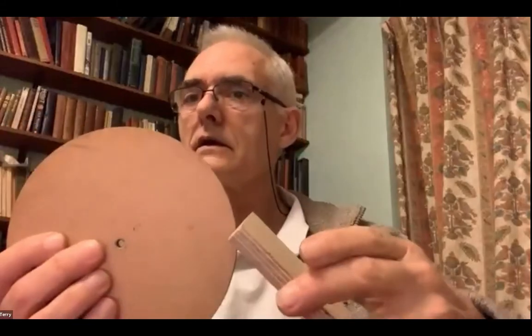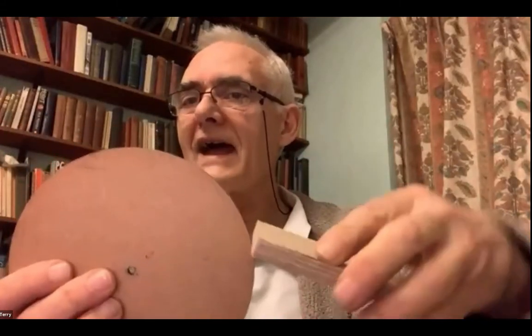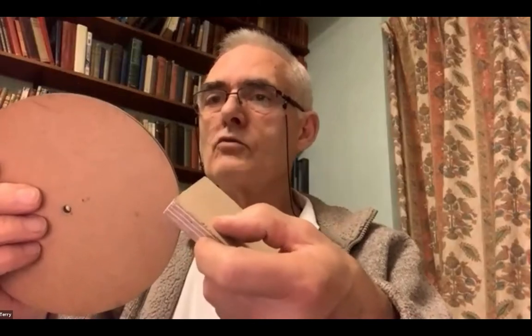You can make systems like this. If you do, it's best to have the pivot point at the front. So pivots like that, not like that. That works, but that's better, because doing it this way, you stay close to the wheel. For safety, the gap between the tool rest or platform and the wheel should be absolute minimum, almost touching, so your fingers don't get in there. When you're grinding, you're working with the fingers very close to the wheel, so you have to watch out for that. So platform grinding for the flat tools is very easy.